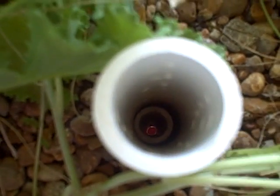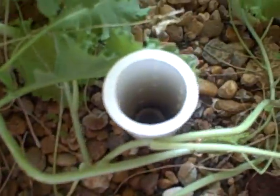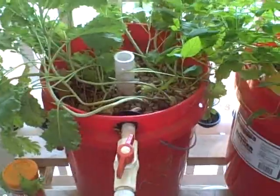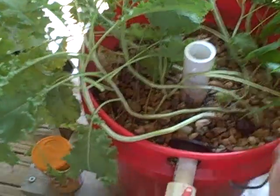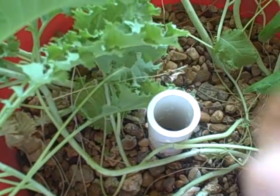Because the bucket actually cracked, it's not as watertight as it used to be. That sets the maximum level — the height of that standpipe. At the base of this pipe, inside the bucket, there are two drill holes which will allow it to slowly drain out at the bottom. So what happens is, at the beginning of the hour the pump is on, and it pumps much, much faster than it drains out, so it'll fill to the top and then overflow into the top of the standpipe.